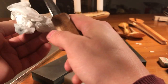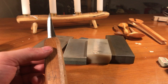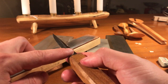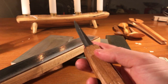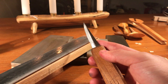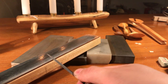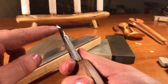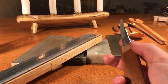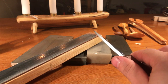I realized that's probably a lot of information to take in. Another thing - when it comes to stropping a knife, you do not sit down with your little strop and do that a hundred times. That is not the way to do it because it will convex the edge. Some people sharpen their knives only with the strop and that is not the way to do it - you will create a convex edge. You cannot make spoons with a convex knife; you need it to be flat so that you have control over where your knife is cutting. When making straight lines and curves you need to know how quickly it turns inside the curve, depending on the flatness of your knife. If it isn't perfectly flat it will turn more quickly and you will not have control - you cannot carve a flat surface because the knife will not reference against the flatness of the bevel.